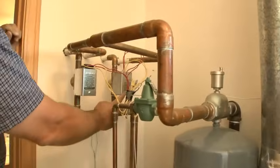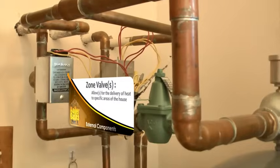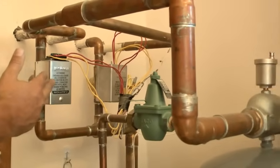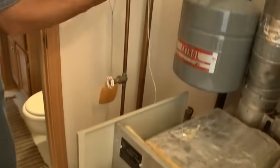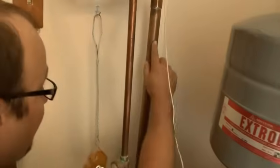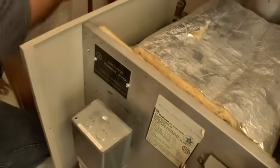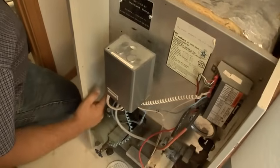Here's one of the zone valves, and here's the other zone valve. The system runs at one temperature — whatever temperature the boiler runs, that's what we send. Return water comes here, down each one of these pipes, through the back, into the bottom of the pump. The pump is right here, pulling water and then pushing it into the boiler.